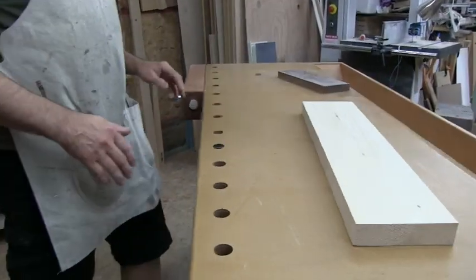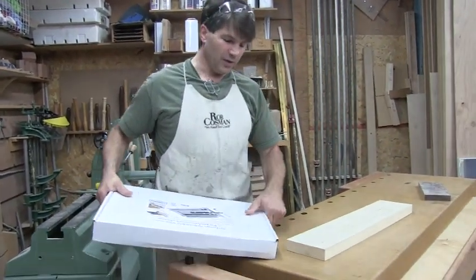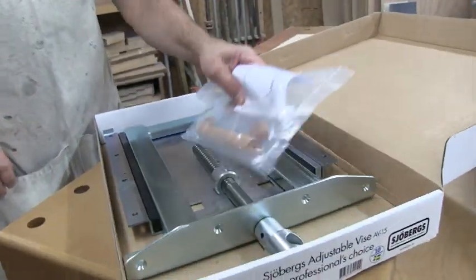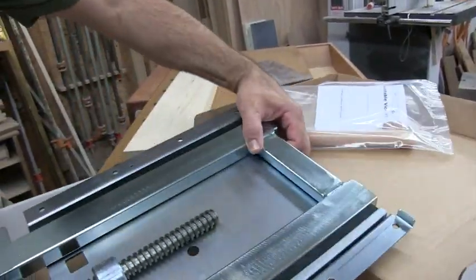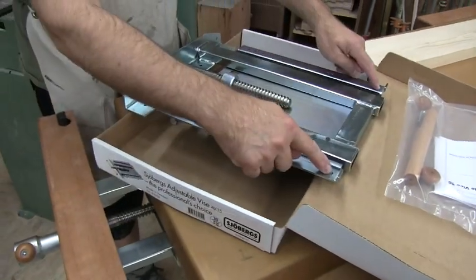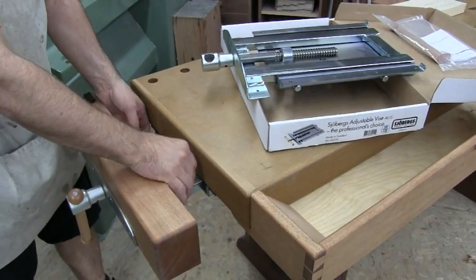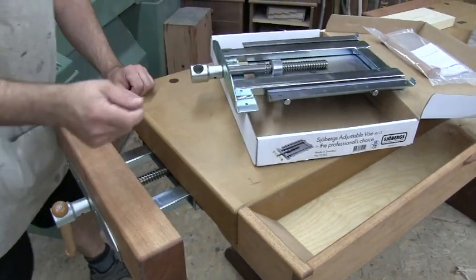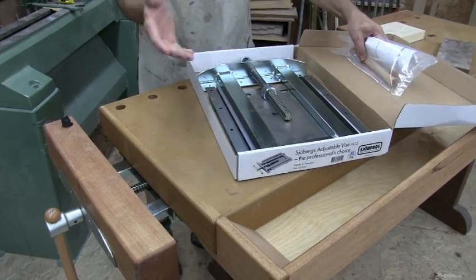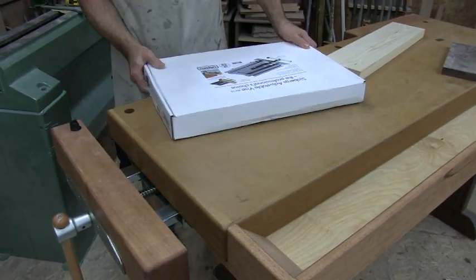So we had a great assembly bench and then thought: why couldn't we convert this into a cabinetmaker's bench? A company called Sjoberg makes what could easily be called the best woodworking benches you can buy today, particularly for the money. You can also buy their vises — you add the wooden jaw, they give you the handle, and it bolts to the underside of your bench with four bolts on either side, eight total. It uses rectangular tubes instead of round tubes so it doesn't rack nearly as much — it's easily the best commercially available vise I've ever found, and very easy to mount.